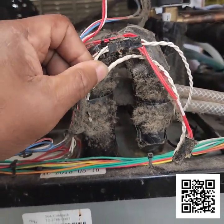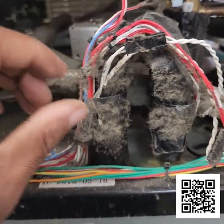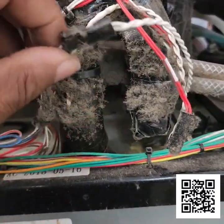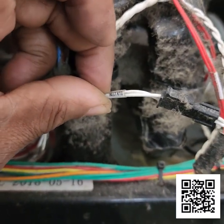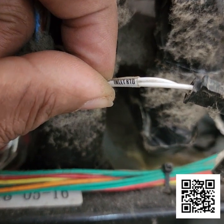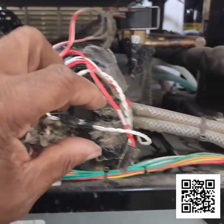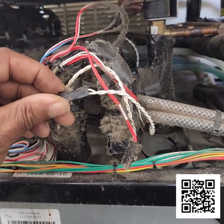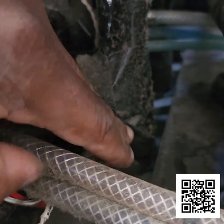And usually these wires are wire tied up against this line right here, and you can usually see they do label the lines pretty well. So this one here is the inlet line for barrel number 3. So I'm going to go ahead and get another return temp sensor, I'm sorry, inlet temp sensor, and then I'll replace that. That's going right over here.